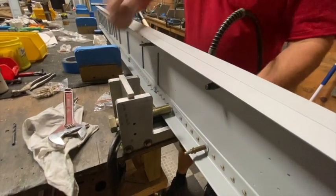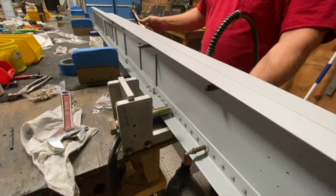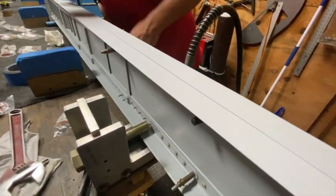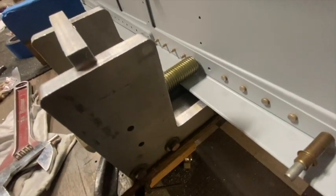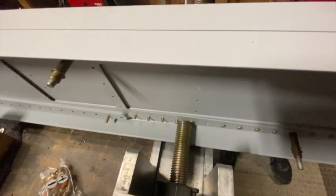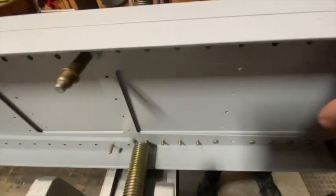It is important that when you put in a row of rivets, put in about five at a time and make sure they're all the right length — even I earlier today put in a rivet that was one length shorter, had to drill it out. A little visual check will save yourself some time. Once you've got it adjusted with your one and a quarter pumps, the handle comes up again, goes down just a little with the weight of the handle. Then you pick the handle all the way up and go one, two, three, four, five — that's your five pumps.